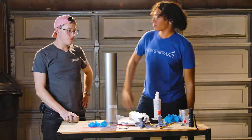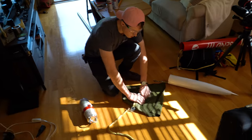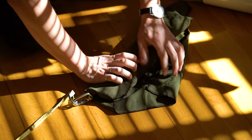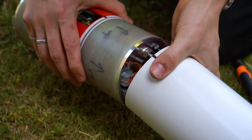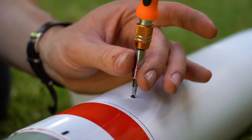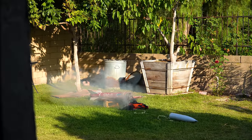With the pop test done for the drogue chutes, my friend Andrew Adams and I set out to pop test the main parachute. We've got the chute folded — it's pretty tight and we're going to go a little bit tighter because it's not going to fit great in the nose. We're going to make a little Nomex burrito here into the nose cone, attach it to the clips, put it together, and integrate. We're not going to power anything on until we're ready to actually pop. Three, two, one. It comes out.